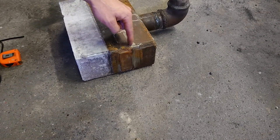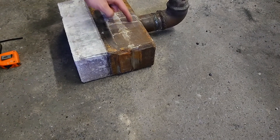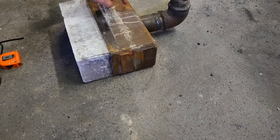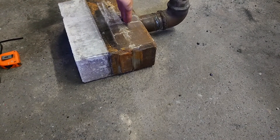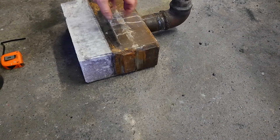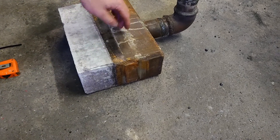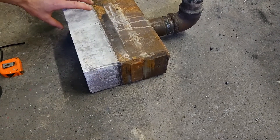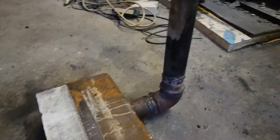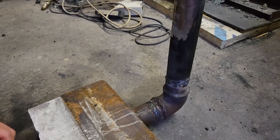Inside the top part there is a stainless steel mesh with 10mm or 8mm diameter holes in it. That stops you tunneling straight through into your middle jets, creates a bit of turbulence - we like a bit of turbulence - gives you a nice mix and a much more even spread across the ribbons on the burner. The supply is two-inch bore pipe with malleable iron fittings, welded together.